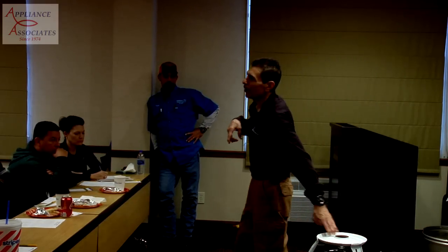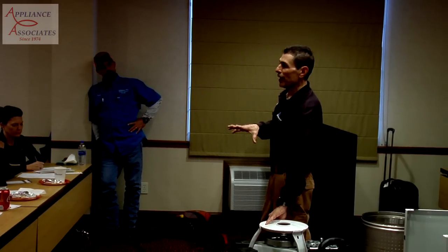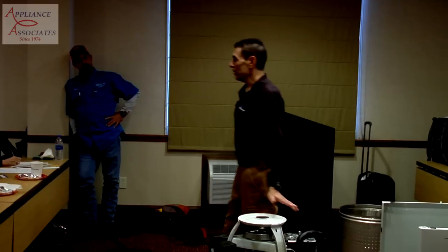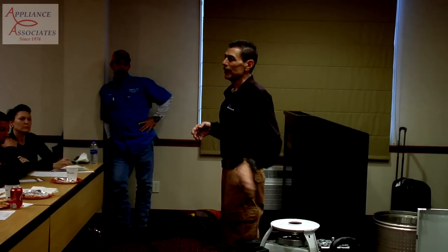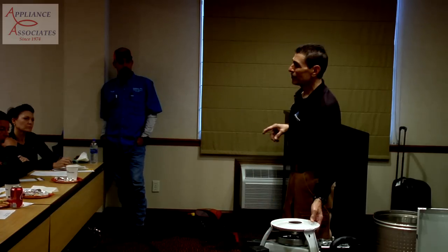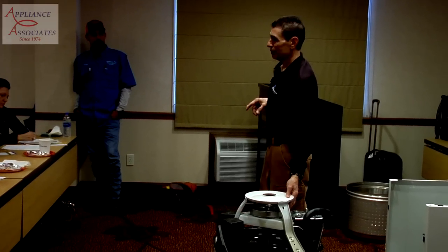Okay, so the nut holds this pulley in place. That pulley is aluminum, and it came from our large dryer line. Same ideas there. The tension of the belt, as we spoke, is preset. If you reassemble the motor and you throw a washer in between the motor plate and the weldment by mistake, maybe you don't remember, accidents happen, that motor will sit funny. And when it does, the belt will sit funny. The belt actually has to ride the center of this pulley. They want it at the center for the best read. Okay.